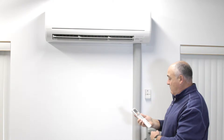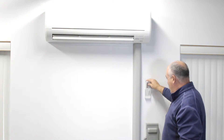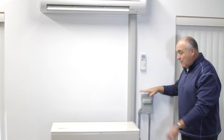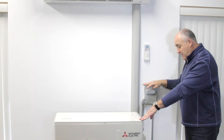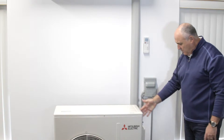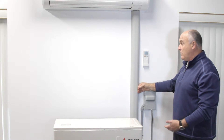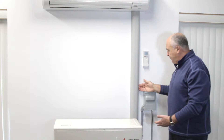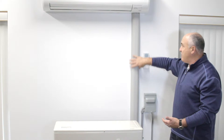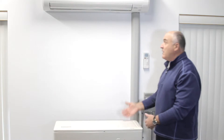You can turn the unit off from the remote control and put it back in the holder. The electrician does the outdoor work and puts a disconnect outside. This unit needs about a 25 amp service, while smaller units can be as small as 15 amps. The line hide on the outside of the house comes in different colors - this one is gray, while the others I showed were in brown and white. The gray works well for cedar shingle homes where the siding tends to gray out, so it blends in nicely. This is your 24,000 BTU, a little bit bigger unit.